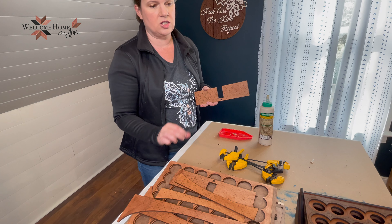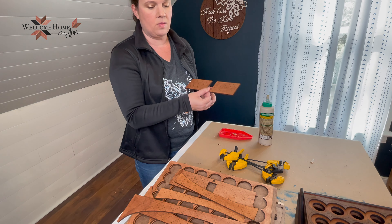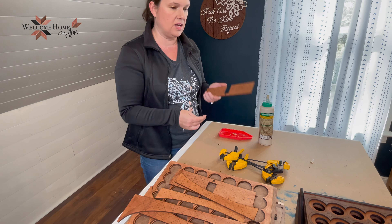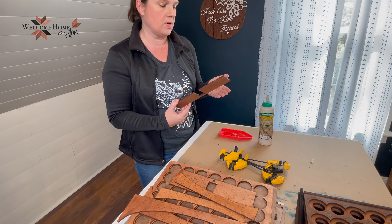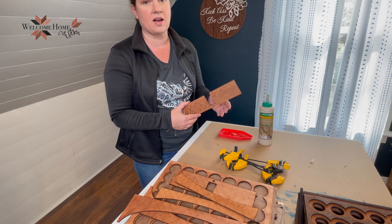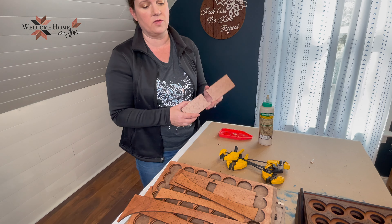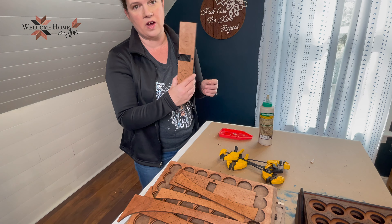This is not taking into account kerf. So you cannot measure your wood with calipers and then know what size to use because everyone's kerf is different. So you're going to either need to pick yourself up a kerf tool, a measurement tool — they're available to purchase and also for free online, I can link a couple in the description below — or you need to figure out the kerf of your laser and then subtract your kerf from the file slot number. So that's number one: figure out which file you're going to use.